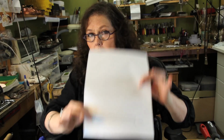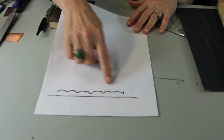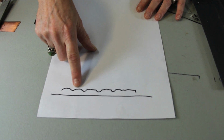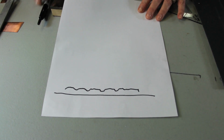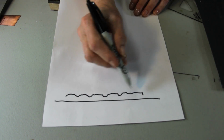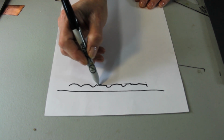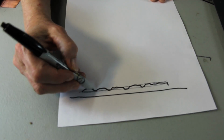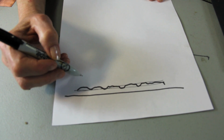The hard part comes in cutting it and then having it perfectly cut. So sawing will always end up leaving you with little bumps. I have a visual aid today, like this, and this is magnified greatly. But generally, when you saw, you end up leaving little pits and divots like this. And here's my pen. When you file it or sand it down, most of the time people just take off the tops of the little, whatever, let's call them hummocks.